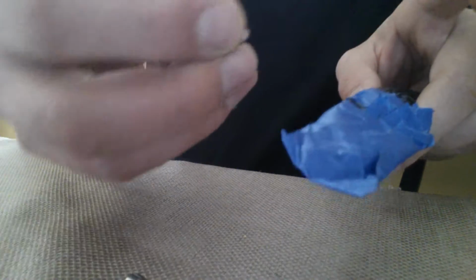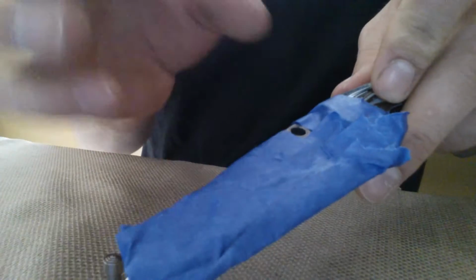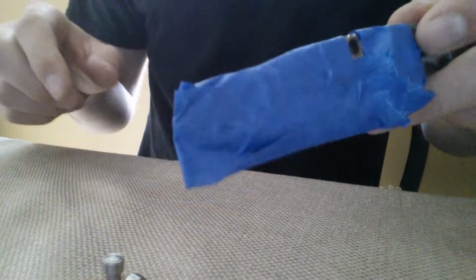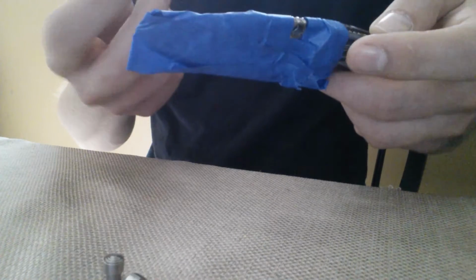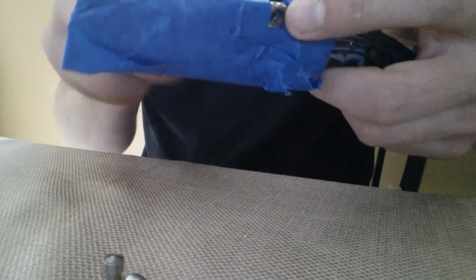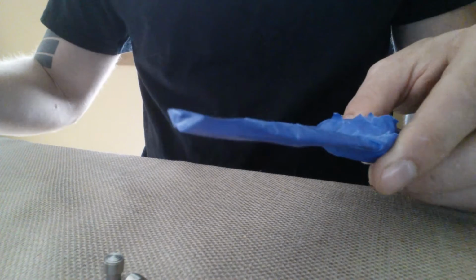So after that, you're going to have your stud. There's going to be a threaded side here, and then there'll be this side with the shank. And some of them might be really tight because that Loctite kind of seeps in and around in there when I put these on, and it might have filled up. So if there's Loctite and gunk inside of the hole where the thumb stud came from, you can take a Q-tip with some acetone or fingernail polish remover, or even alcohol, and just swab around inside of there and clean it out before you put the new studs on.